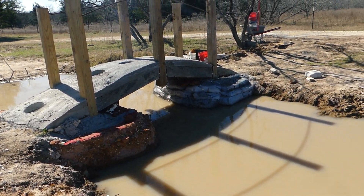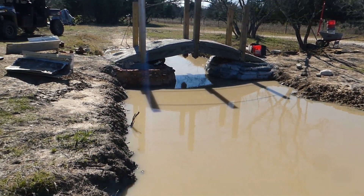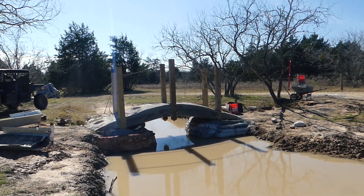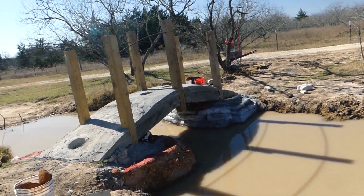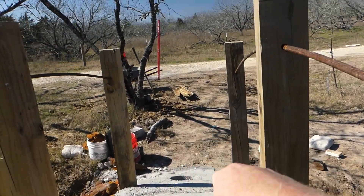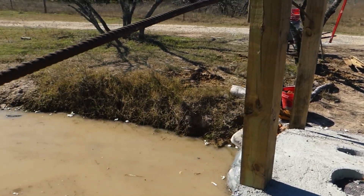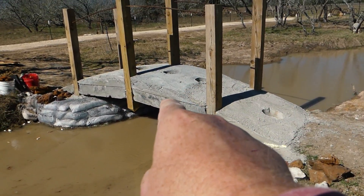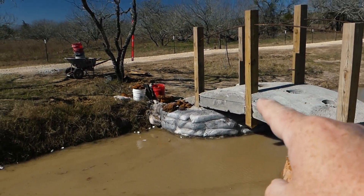That looks pretty good everybody. For a DIY concrete pedestrian bridge — it's not done, it's all still in the rough — but the charm of it's beginning to come out. I almost tore the frames down several times because I was so disappointed in how it was turning out. But I thought, don't judge a book by its cover, do it all the way. Each one of these sections is a different mix test section. These will all be covered over with one skim coat of stucco in white and the post will be red. I did see one failure of the hyper adobe as a dam abutment — as the clay swelled, it put a crack down the mortar on the back side. I'll patch that too.